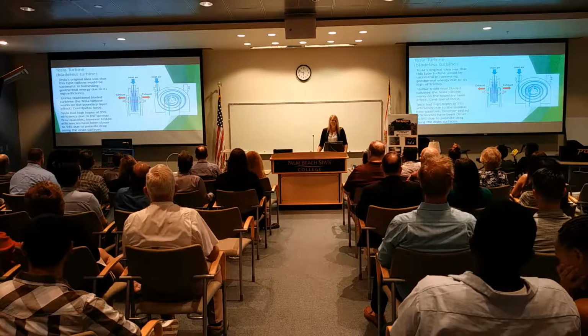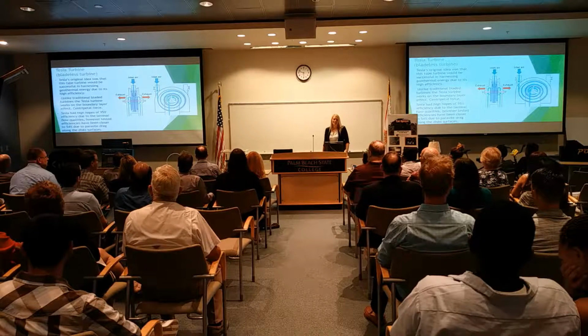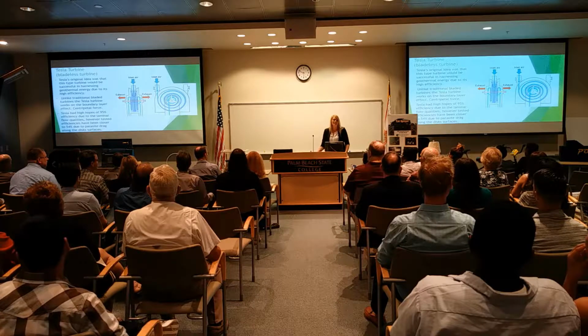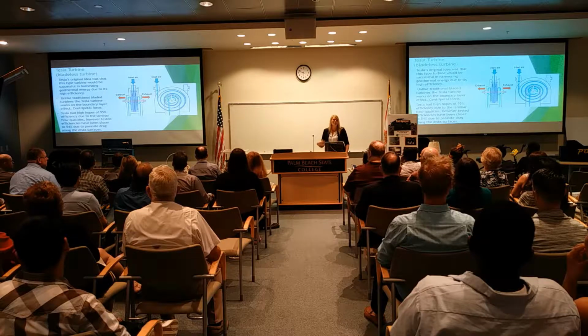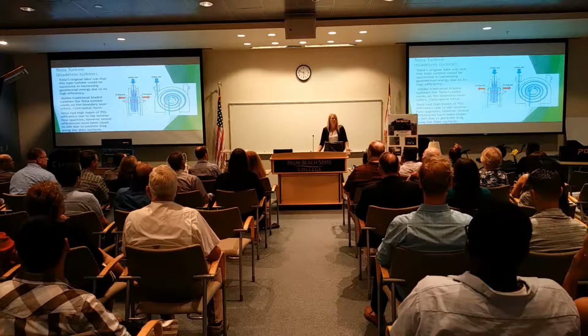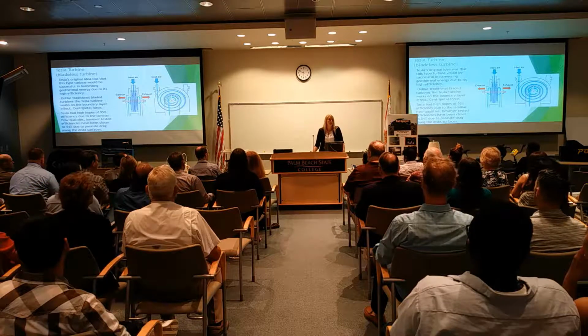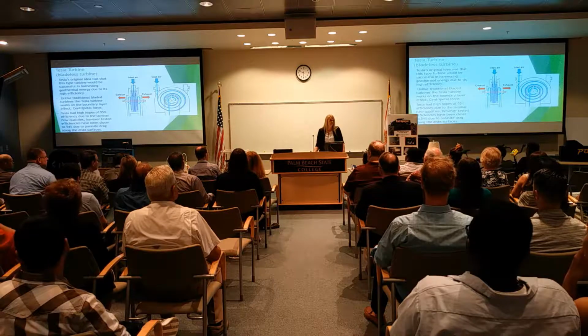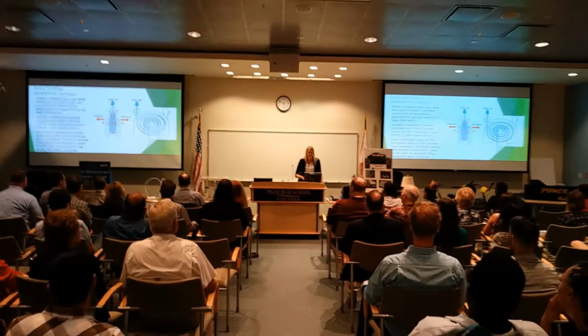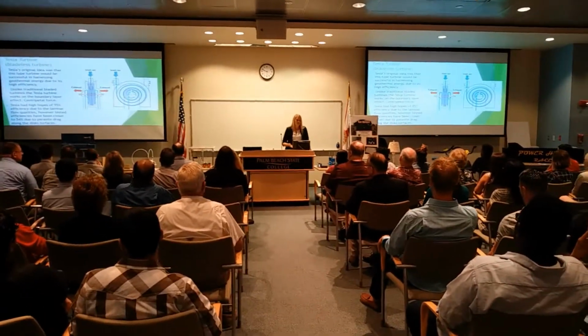So his original idea was that this turbine would be successful in harnessing geothermal energy due to its high efficiency. And he projected that the efficiency rates would be closer to like 95%. However, it's later been tested that they're closer to 54%, but in general speaking terms, that is actually extremely efficient. Most standard turbines today run between 21 and 32% efficiency, and in a power plant situation, that is a lot less efficient than 54%.